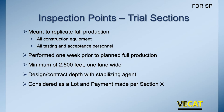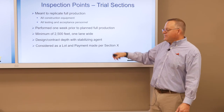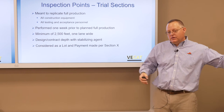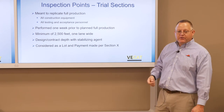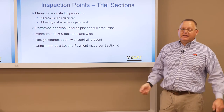We're checking the contract depth — if the design called for nine inches, we ensure the reclaimer went down nine inches. The trial section will be paid based on results. If it goes well, we move on to full production. If we have issues, the department can require the contractor to bring in an expert technical rep to determine why we're not getting the necessary compaction.